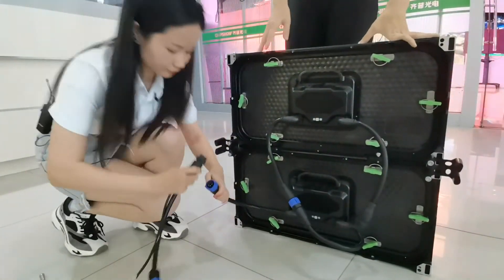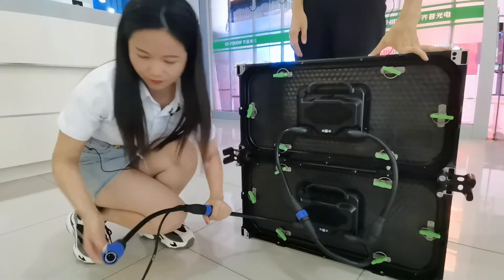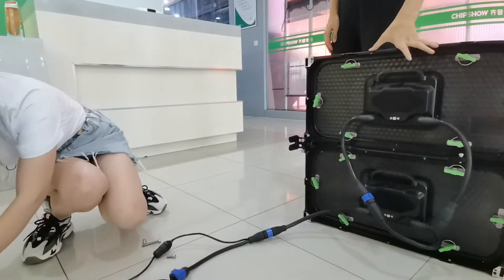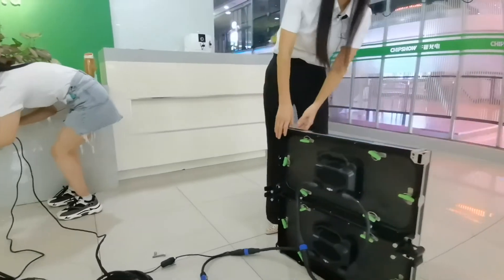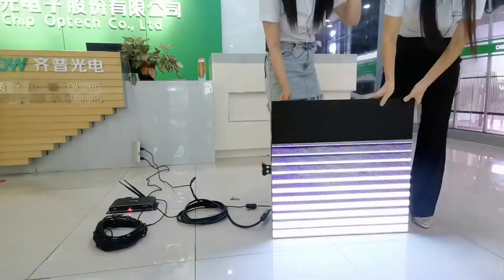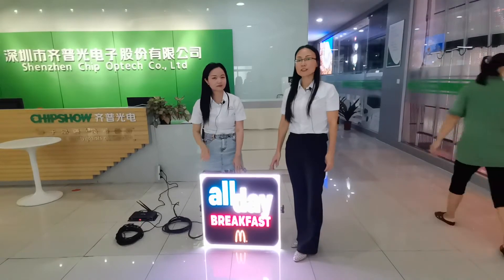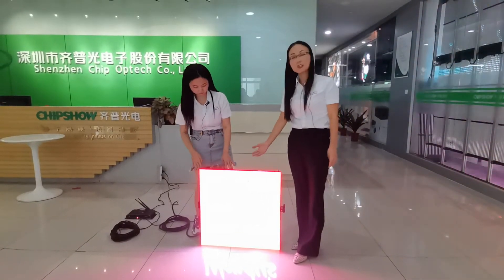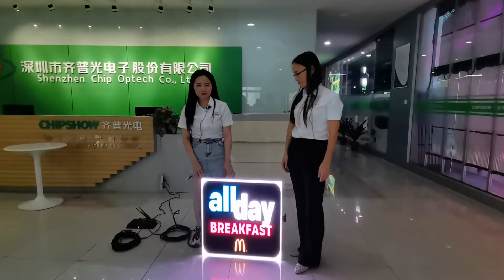Connect the keyboard to the controlling system, plug in, and power up. See how easy it is to connect our LED panel with the 2-in-1 cable. The current brightness is 2,000 nits. Brightness is very important for outdoor use — you can set it up to 7,000 nits. Here we have two panels mapped together. You can install the panels in any size you want, such as 8×4 feet, 10×5 feet, or 12×6 feet.